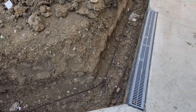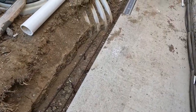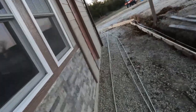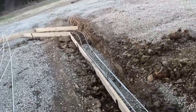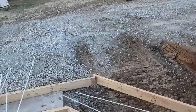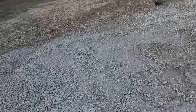So from the beginning, I've just got to get these footings set in so I have something to stack the rock on. This is on the side of the house. There's a nice beautiful cistern that we collect rainwater out of for Bee's processing kitchen. I'm going to pour this sidewalk while I'm in here, but I'm really doing it for this retaining wall. Got to put some rebar down in the bottom. This was the first time I've used the fiberglass rebar, so I'll have to let you guys know in five or six years how well that fiberglass rebar held up. But it's a pretty easy process.